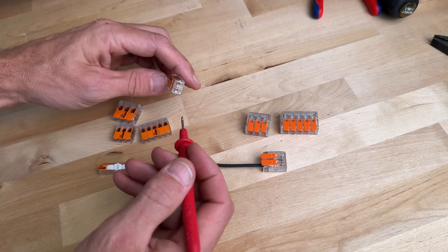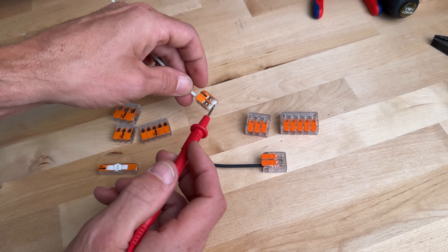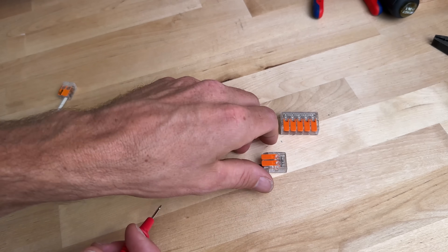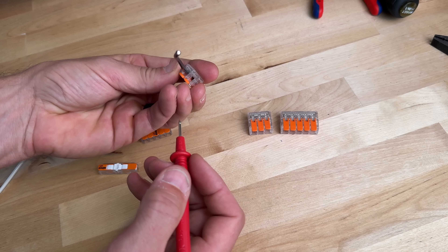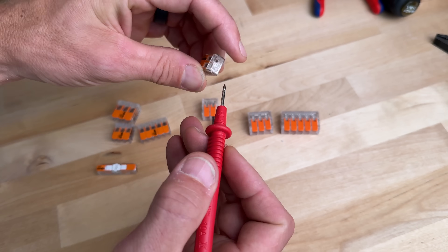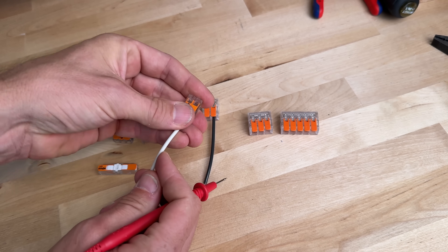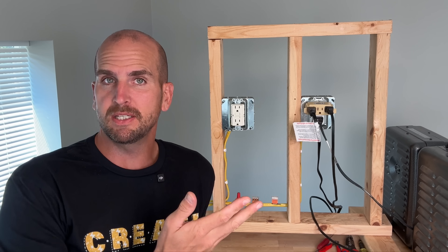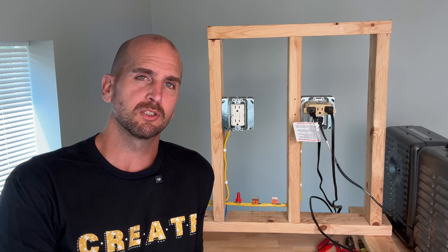Another con is with test probes on your digital multimeters: WAGOs have actual little ports where you can directly contact the bus bar. So while in use, you can test your circuits and troubleshoot to see if you're getting voltage at your connectors, which comes in handy for different troubleshooting scenarios. The Harbor Freight version does not have that test port. WAGOs actually have it not only on the back but also underneath one of the levers. So overall, I'd give pricing as a benefit to the Harbor Freight lever nuts, but I would go with WAGO on features, test ports, and sizing for 15 and 20 amp circuits.